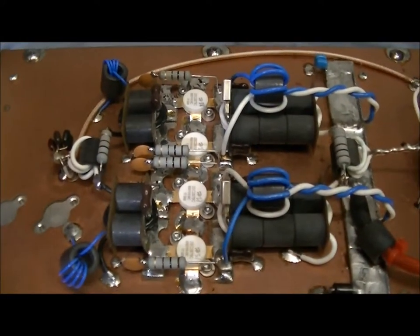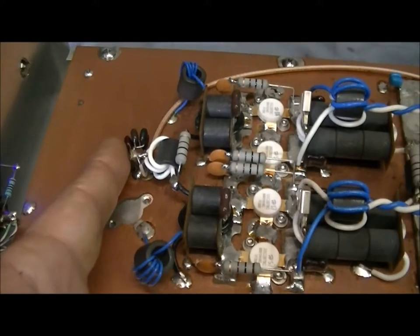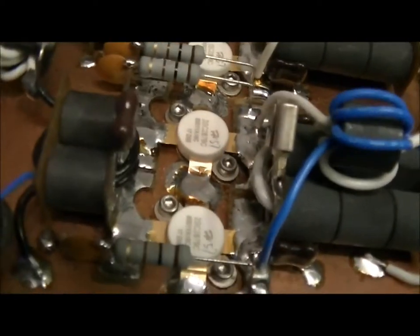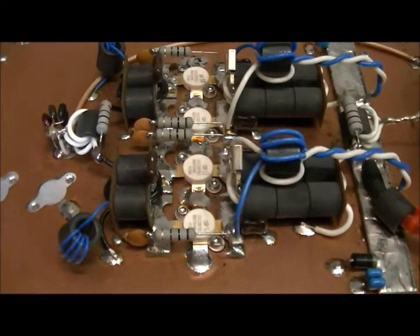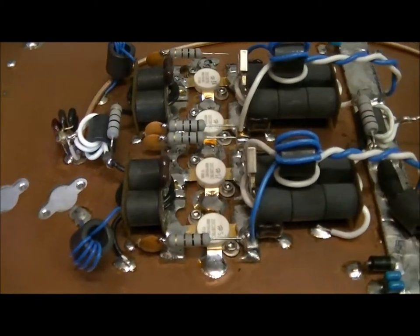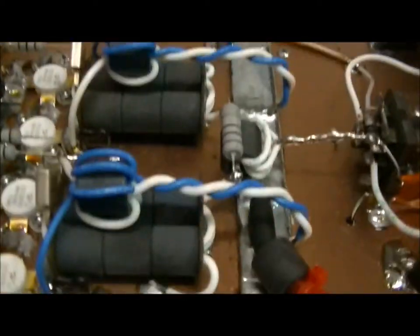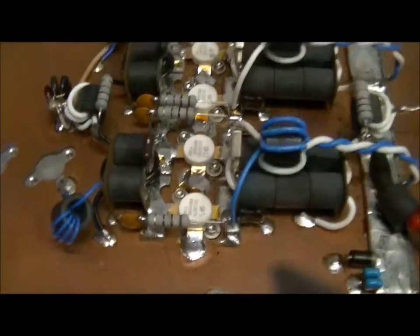All right, I was able to get the input down really low with this, which is really good. Basically, the normal tune that I had, I just had to add some capacitance. If I remember correctly, it was about 39 picofarad worth of capacitance I had to add. It seems like it's up a little bit, which makes sense with two more chips, so maybe it needs a little more input capacitance to ground. I think it was like 220 starting off, so you can do the math.